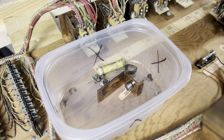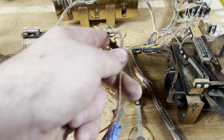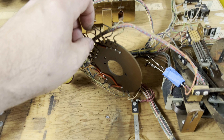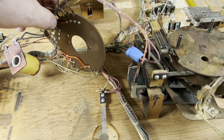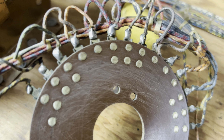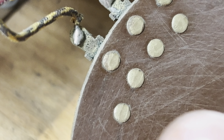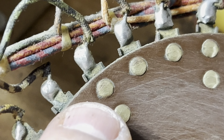As you can see, I got some parts here, some parts just laying there. I'm in the middle of rebuilding this — I believe it's the pitch unit or hit unit. There's the hit unit. If you can see really good, these contacts have taken a beating over the years. They should be nice and round, but see how they've got like a groove running through them — they should be more rounded off like that one. See, these ones are real bad.